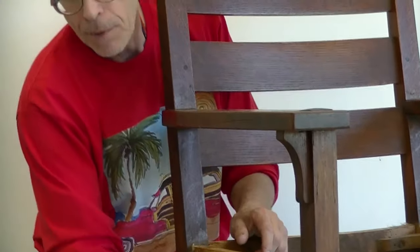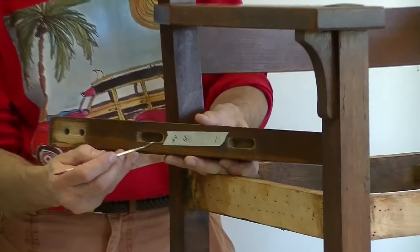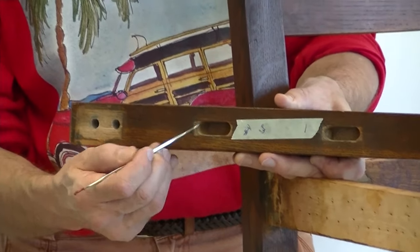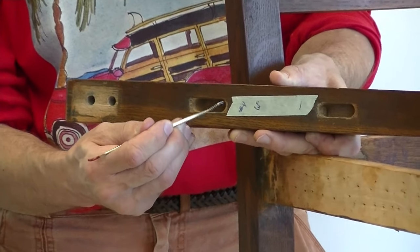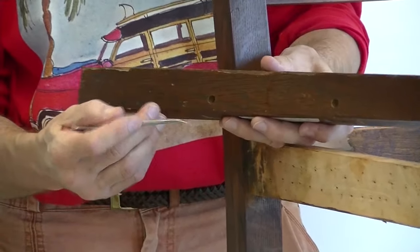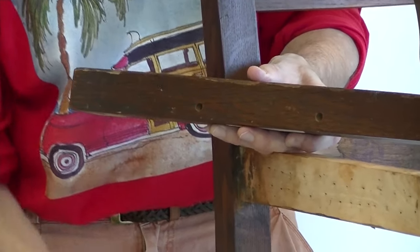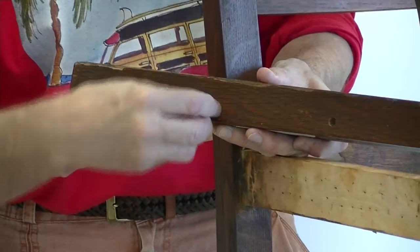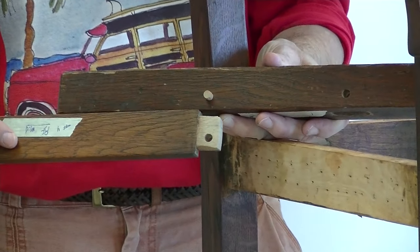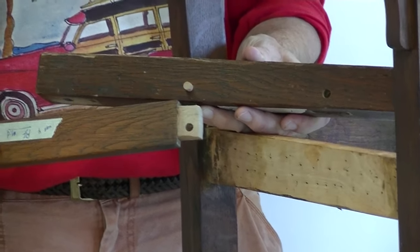I'm going to pull up a leg for you to see the mortise as you come in closer. The walls are really precise. They left a coved section on each end of the mortise that allows a little bit of room for the tenon to move within it. Then there's a pin — a mortise that was drilled directly through the surface of the leg — and a little dowel pin was created and installs thusly. The tenon has a bore hole through it, and that's where the pin comes through and hooks everything together.